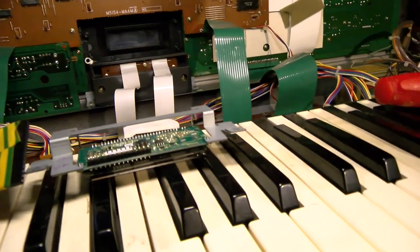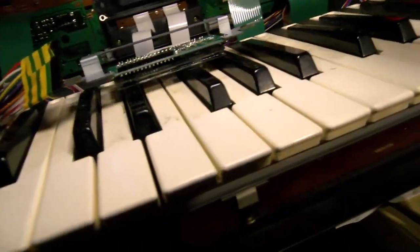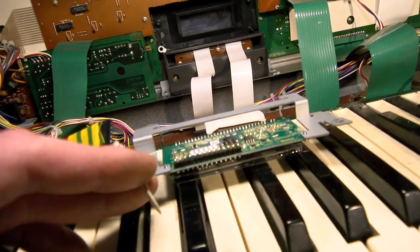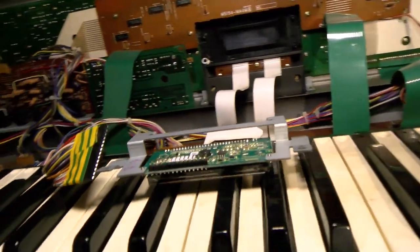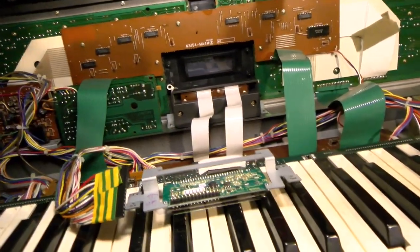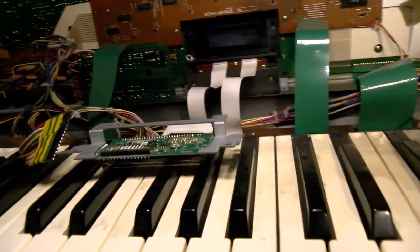Of course, messing something up like that is a risk with an LCD display, but with the VFD having relatively high voltages on board, about 50 volts, it probably makes it a bit more of a possibility. Especially with its more dense component count, as, well, it needs more parts on board to make it work.